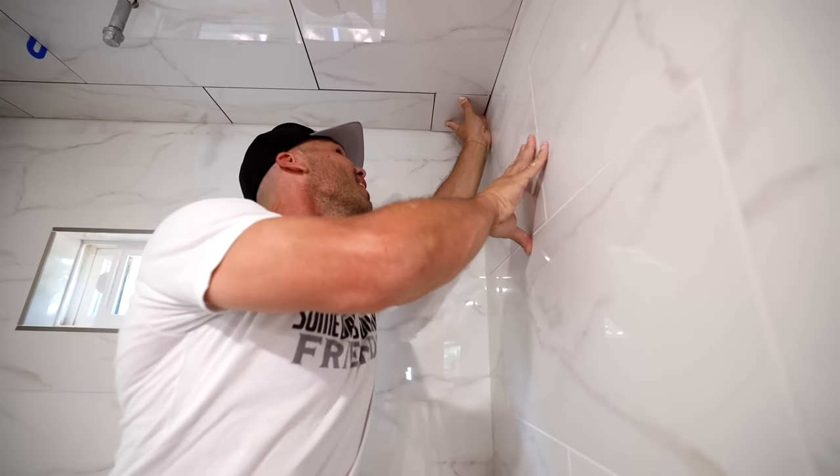Welcome to Tile Coach. I've got a cool video tiling a ceiling — this can be tricky. We already ran into an issue using Multimax Light thinset. We had two tiles drop down. This can be pretty sketchy and you want to be really careful when you do this. We had two tiles fall and drop. One hit Kirk right on the cheek and he got a good little gash. So be careful.